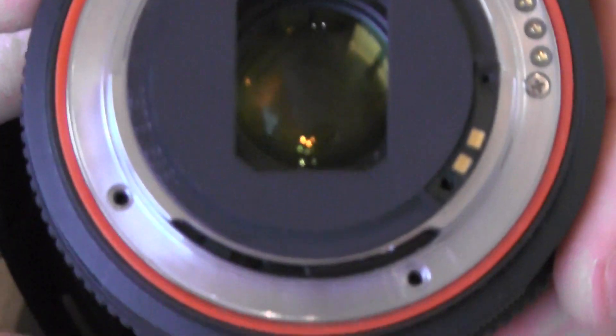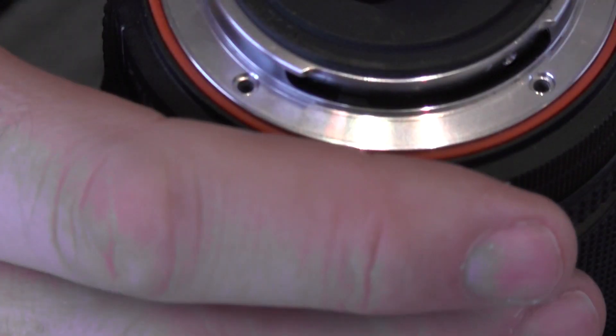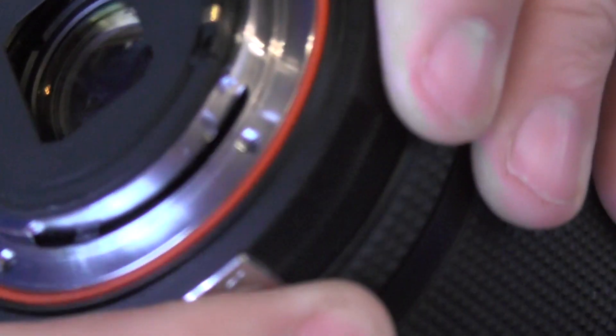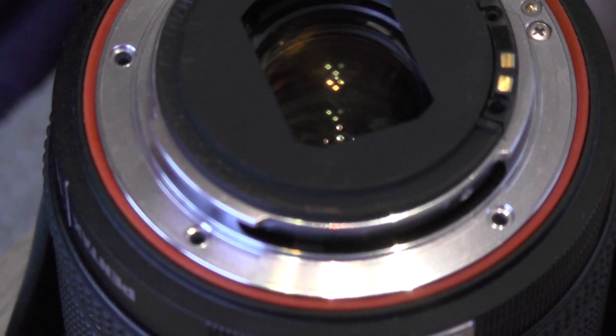Does it work? Does it focus? Yes, it does — everything seems to be working perfectly. Does the aperture work? Yes, it does. Excellent. All repaired, all good. Now I can take the lens back off. Two more important things: number one is just replace all of the other screws around the mounting plate and around the autofocus contacts. Secondly, you can't fiddle around with all of this without getting your fingers all over the back element, so that's what the cleaning solution is for along with the brush. Give it a good clean before popping it back on the camera. Thanks for watching and good luck fixing your lens focusing and aperture problems.